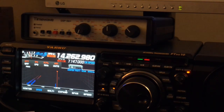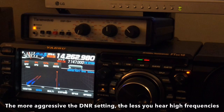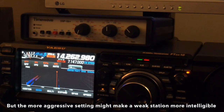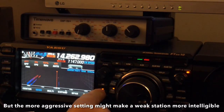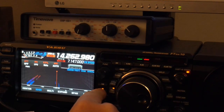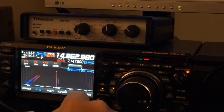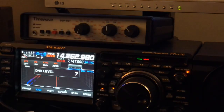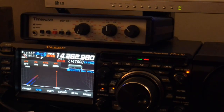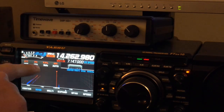So if it's a situation where you can barely hear somebody, by all means run it at a higher level. Bandwidth is at 2400 digitally with a three kilohertz roofing filter — that's the physical bandwidth. Then digitally I've narrowed to 2400.